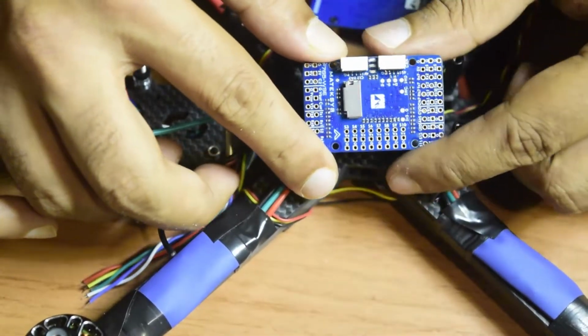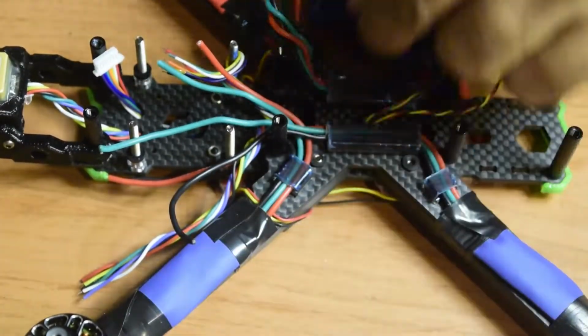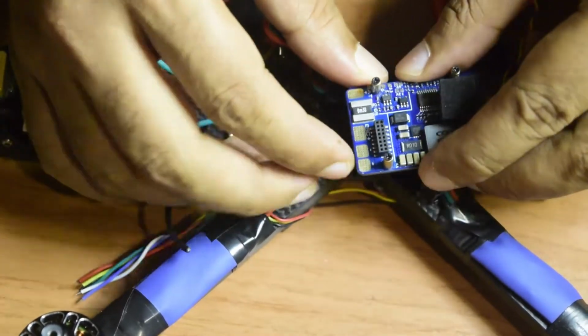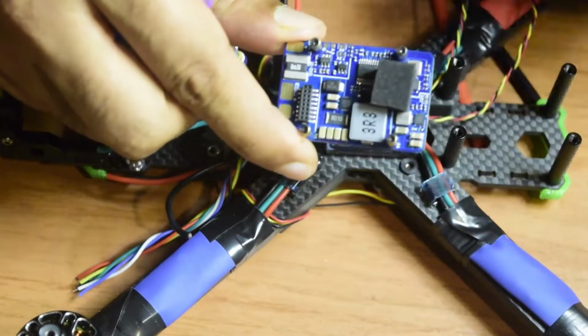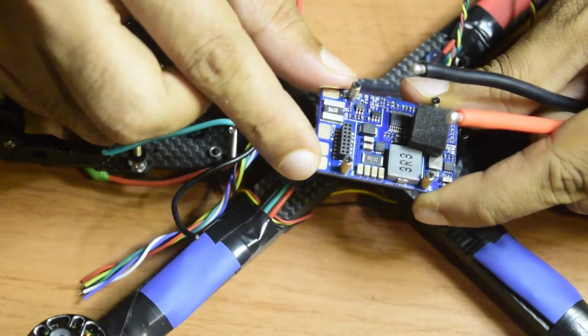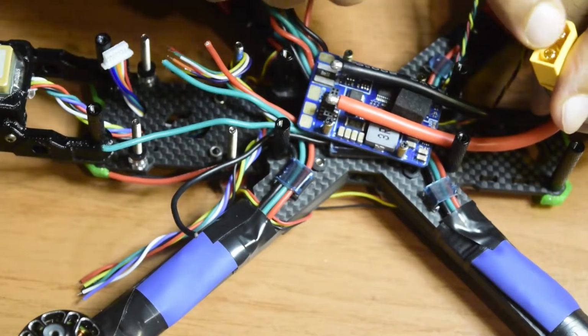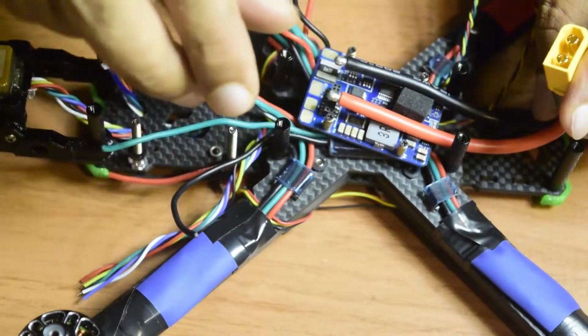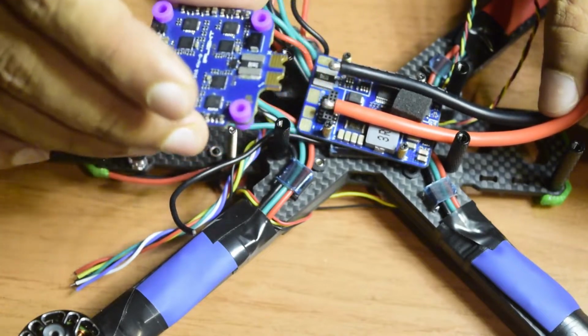So guys, ensure that you have watched that video so that you understand the wiring diagram, how I'm going to connect this. Also guys, on the bottom side frame of my ESC, as I have told you before, I have an ESC power supply here, ESC plus and ESC minus, which I am going to connect to my ESC power input of plus and minus here, and then I'm going to power this flight controller power distribution board using the wire which came along with the ESC, red to battery plus and black to battery minus like this here, and then this battery junction will be coming out from the front side and my battery will be placed on the top side stack whenever I close this drone frame. So this is it guys, this is my plan on soldering all the wires here on my drone frame.